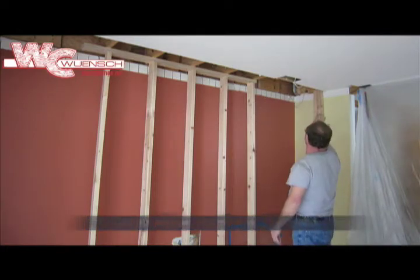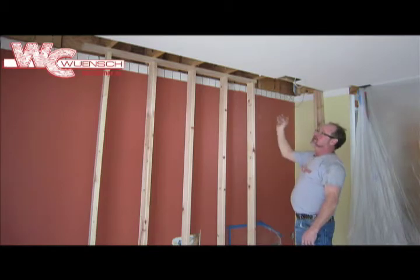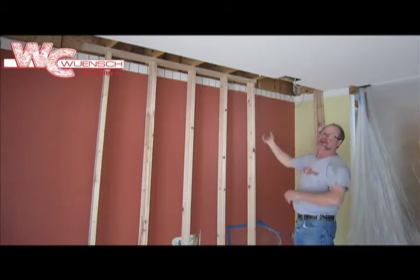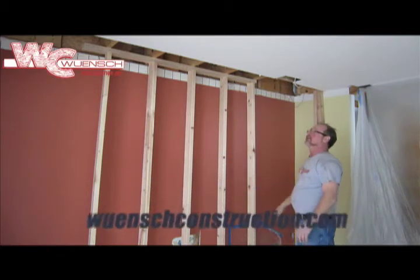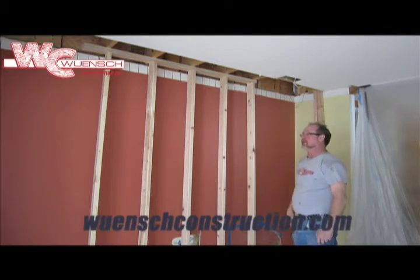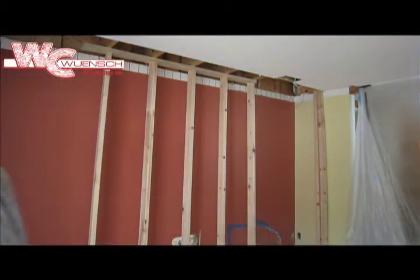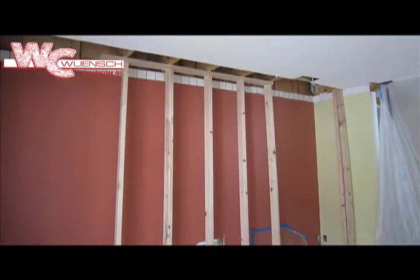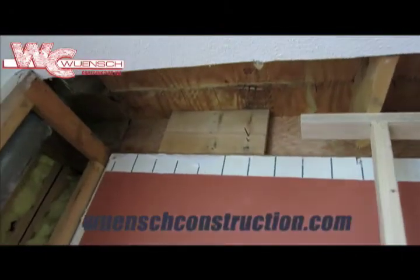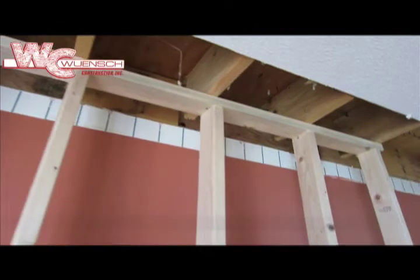I got a support wall here holding the weight, and there's a beam over here with a support post holding the weight. Next thing is I'm going to nail the LVL together, then put another LVL in, push it in, and then put the final LVL on — and that'll be it. I'll block this area in here for sheetrock and then tear down the wall. You can see in there that LVL in there, got some support blocks in there too, just for safety reasons.